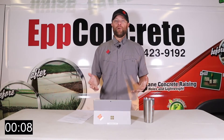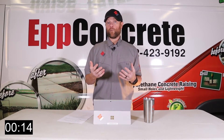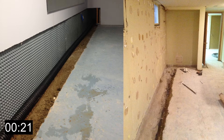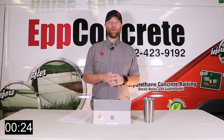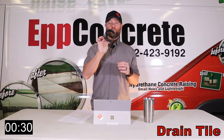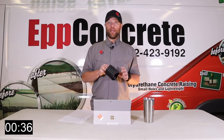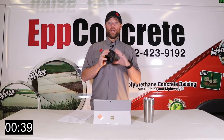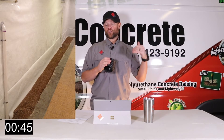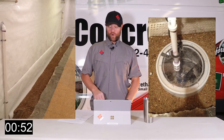What are the three top methods if you have water coming into your home or if a home needs some form of waterproofing? The first one is going to be an interior drain tile system. An interior drainage system is drain tile that's usually dug in next to the footing. This is three inch perforated pipe drain tile. How it works is we break out the floor, dig this in next to the footing, put rock and a water controller next to the wall and on top of the footing, control that water, and bring it into a sealed system directing the water where we want it to go.